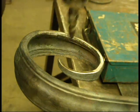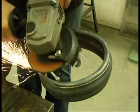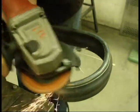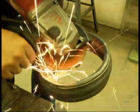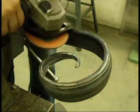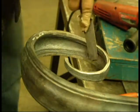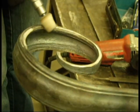After that it's all a bunch of grinding. Grinding cleans up everything that you did wrong, basically. You see this machine a lot in movies — they used it a lot in Battlestar Galactica. It's an angle grinder, it creates a lot of sparks, and people really like seeing it. It's a really pretty machine to see being used, and also one of the most boring things you can do with metalworking. I will be doing this for hours when I'm working on this piece. I'm using an angle grinder with a grinding wheel attachment. I also use a pneumatic die grinder and then just a flat file to clean up anything I didn't get with the die grinder, sanding it down to be nice and smooth on that inside edge.